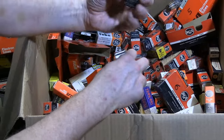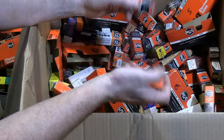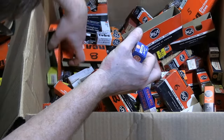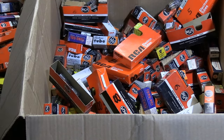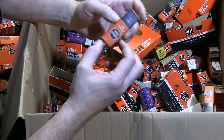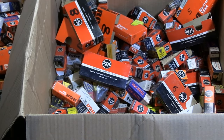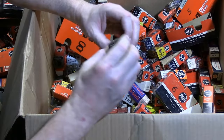Sylvanias are pretty good too. Personally I like the RCAs with the old style logo - classic, they made really good tubes. Tung-Sols are pretty good, Sylvanias are really good. GE, not so much. I've heard some bad things about Raytheon, and Westinghouse aren't so hot. Certainly the no-name or weird-looking ones toward the end of the tube production run are generally not very good tubes. Toward the end the market was rapidly shrinking, they were just catering to the replacement crowd, so quality was dropping off.